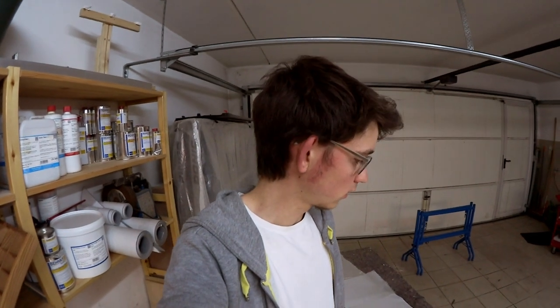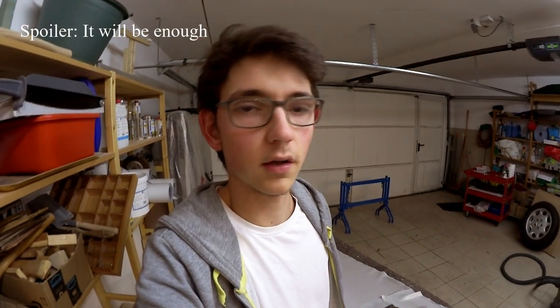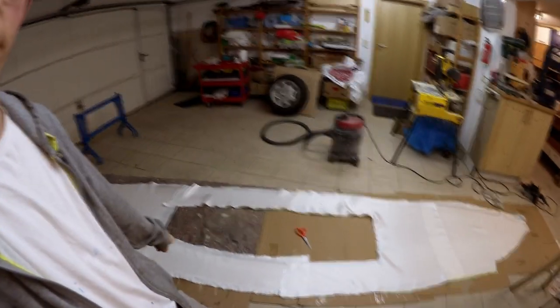I'm going to have to mix a lot of epoxy to wet all of this fiberglass. It's actually my own fiberglass, not the delivered fiberglass that came with the kit, because I have a slightly heavier fiberglass. I hope this will give it a little bit more stability because I hate weak decks that you cannot walk on. I want the thin kit fiberglass to go over the hull because the thick fiberglass is not able to fit onto tight corners.